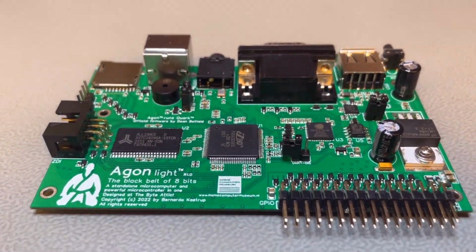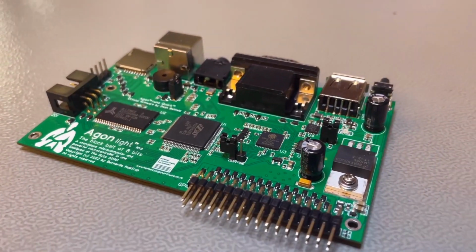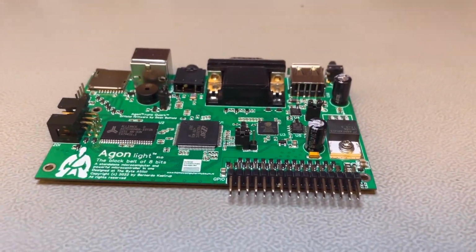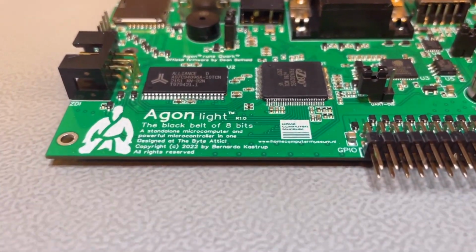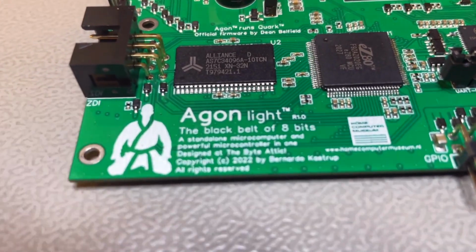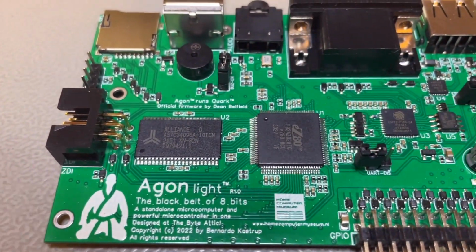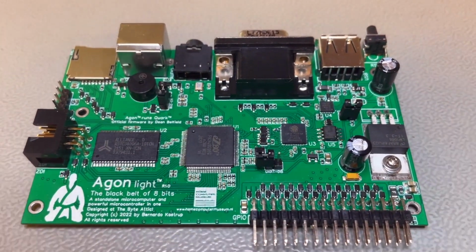And if you are soldering this stuff commercially, I hope this video has helped you with the more difficult parts, like fine pitch SMD soldering. There is a reason to do this by hand and not ask the PCB manufacturers to do it, because they charge a premium to buy the components for you. And you also have import duties, components from the US go to China, and then from China they come to Europe. To avoid all that, you can solder the more expensive components yourself. And that's what I tried to show.